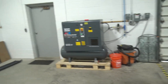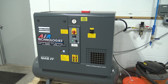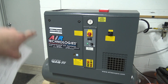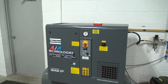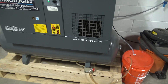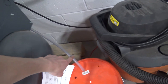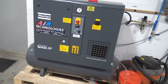Ours has a built-in dryer, which seems to work great — no complaints about that. The air has been really dry, although it hasn't gotten hot here yet. This model is a wet tank, meaning the air goes through the screw into the tank wet, and then when it comes out of the tank it goes into the dryer and out to our system. I'd rather have a dry tank like the bigger units. Every day I turn this little knob and can just drain some water out of the tank. I need to put an auto drain on this — the dryer already has a float valve so it takes care of itself.